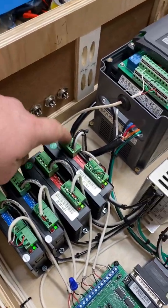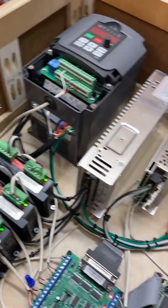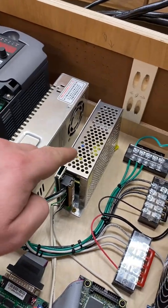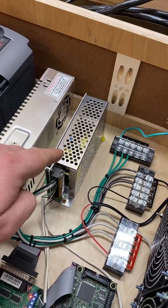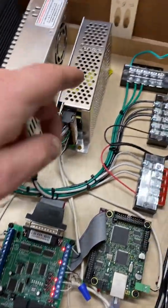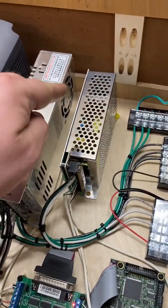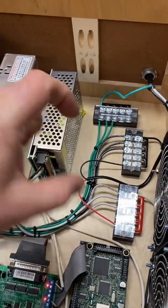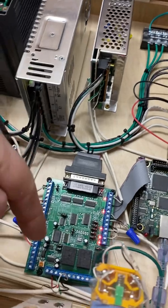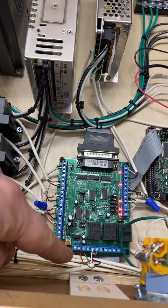These are all my drivers, so they'll be wired to these connections here. I've got my 48-volt - well, it's like a 36-volt output - power supply, and I've got a 5-volt. I just found out that to get this connected properly to this board and be able to control it, I have to get a 12-volt power supply. I'll probably slide this over to make a little room. It goes from large to medium to small, and that will feed the back side of this board - just these last two pins, one and two - those will be ground and 12-volt.